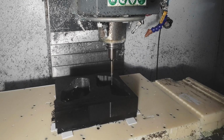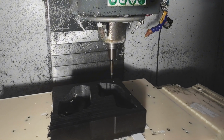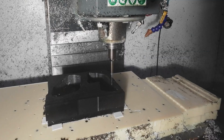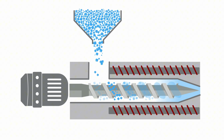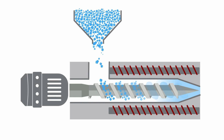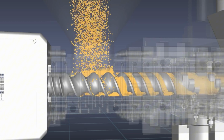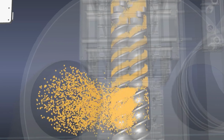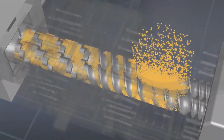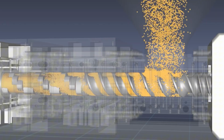The primary cause of deformation in plastic parts is the residual stress within the material. These stresses are released during the machining process, leading to deformation. In fact, these residual stresses are formed during the production stage of the plastic materials. During the manufacturing process, when the plastic is in a melting state and cools down to solidify, it undergoes volume contraction. If the cooling rate is uneven, different areas will have varying contraction rates, resulting in internal stress. Moreover, the orientation of plastic molecules in the flow direction can also cause inconsistent contraction after cooling, further exacerbating deformation.